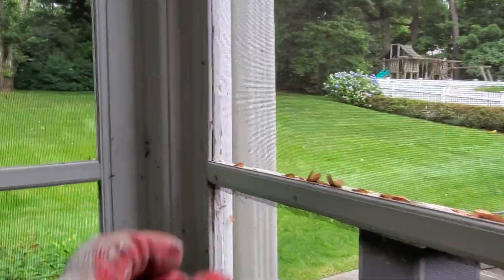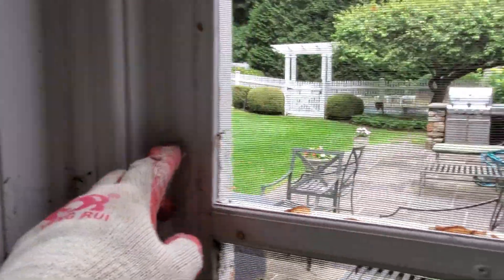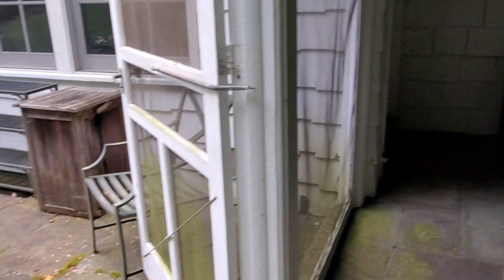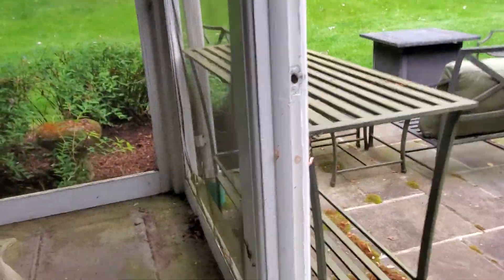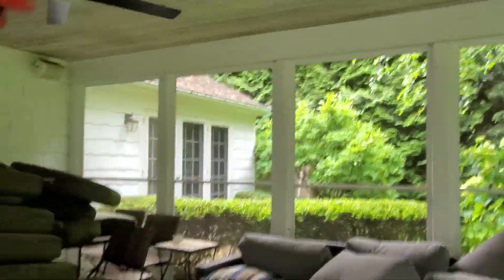For each one of these openings, carefully taking all of this off and putting a little tiny molding in here — that's not helping the project. What this actually needs, the type of molding this would use, is called doorstop. If we use doorstop on this it would be perfect. It's like it's flat on one side and then it comes to a round on one side — like on the inside of your door where your door hits. White painted doorstop would go over it.